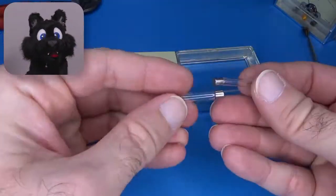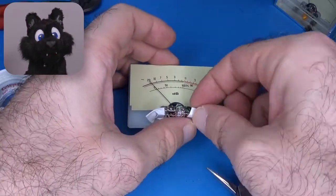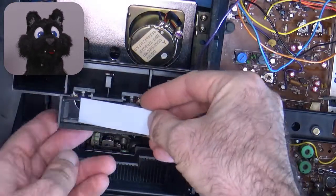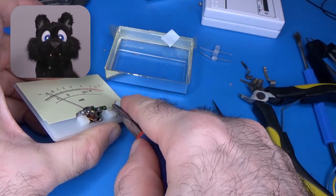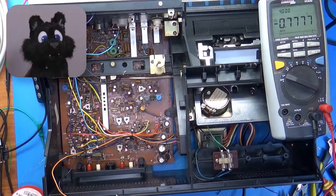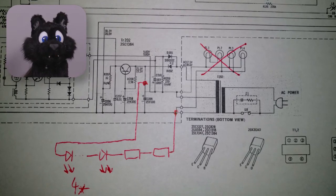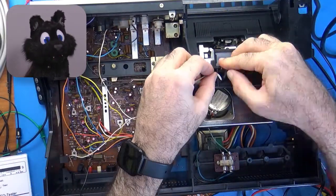The deck uses several lights: one per VU meter and two to light up the tape bay. All of them are special ones, and at least one of them did not work. I decided to do an LED mod — orange ones for the VU meters, and since the tape deck has a blue filter for the lights, I went with blue LEDs there. Since the new LEDs are clear ones and project a rather nasty light cone, I sanded them off to make for a more diffused effect. The lights are driven by the main supply voltage, around 25 volts AC, but now I need DC, so I tap in right after the rectifier. I only need about 15 milliamps for them, so I wire them in series to make it easier on the resistors, using two resistors to divide the power dissipation.